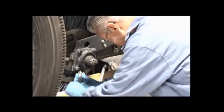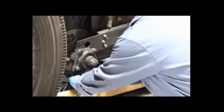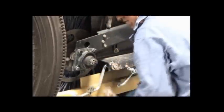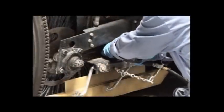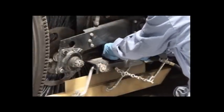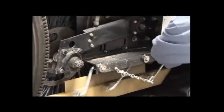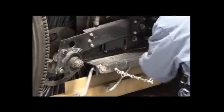Go to the right side of the sweeper and remove the shackle from the right broom lift arm. Remove the three mounting bolts holding the right dirt shoe assembly connected to the elevator side plate assembly, and remove the dirt shoe assembly from the sweeper.